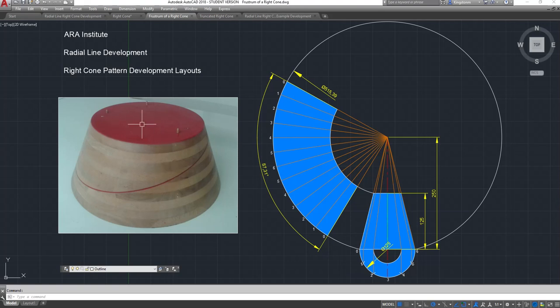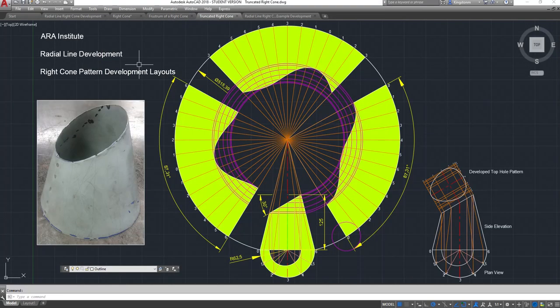A frustum of a cone is a cone that's been cut with a flat top. The side elevation is in the blue portion here and the plan is on the bottom. Looking down on the circle at the top, this portion is always a complete circle because it's sitting flat across the top. Once I've projected this line across to the outside edge, we can swing our arcs, numbered from zero to six, stepping off around the outside - zero, one, two, three, four, five, six, back down to zero. That's how we lay out a frustum of a cone.